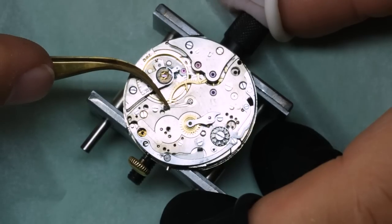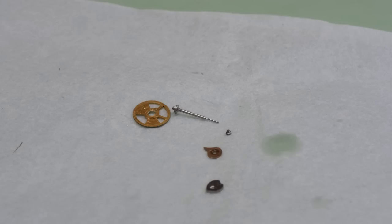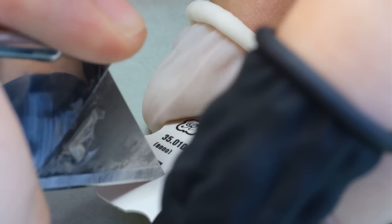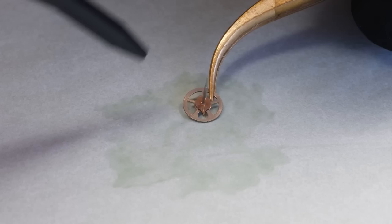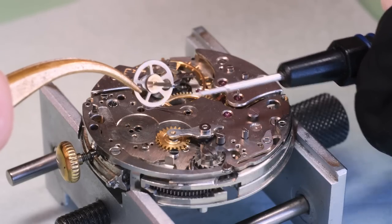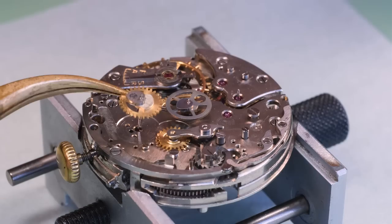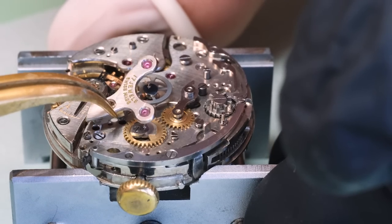One of the big issues with the watch was of course the broken pivot on the chronograph wheel. There are a couple of different ways to approach that — one is to take the wheel apart into the five different sub-parts and re-pivot the whole arbor, but that's pretty fiddly and not really worth the time, plus the pivot is so small that it's very difficult. The other is to buy a new wheel. This wheel costs 165 francs — which hopefully also illustrates that old watches are very difficult to get parts for, and when you do find them you might have to pay quite a lot of money.